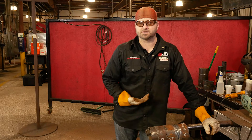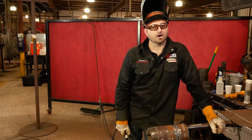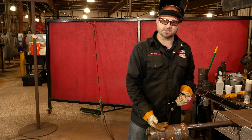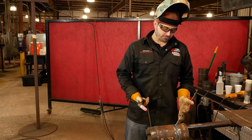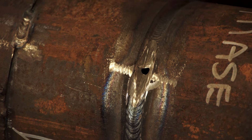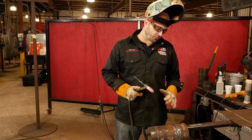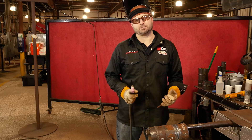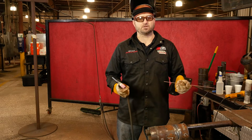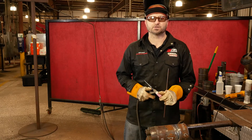We're going to switch everything back over to the TIG process, get all my TIG set up, and then come back and actually put the root back in. We've already talked about the grinding and cleaning it all up — I switched over to the TIG process again. Now we're going to put our TIG root in, then our hot pass, then come back over it with a 7018 and fill and cap it like it should have been done. So let's close up this hole. One thing to watch out for: it's very thin right there in that spot, so it's going to want to rip open. You probably need to turn your amperage down a little bit and feed the wire in there. Be prepared, be paying attention, watch out for these things as you go to fill your root back in.